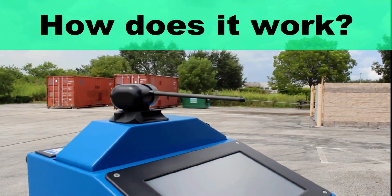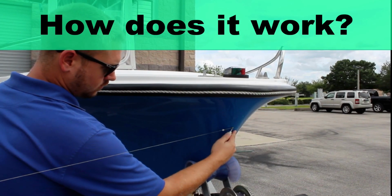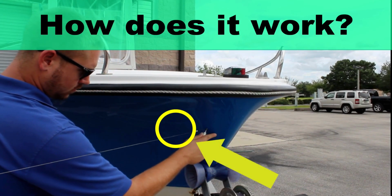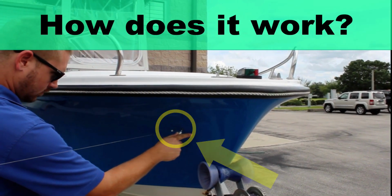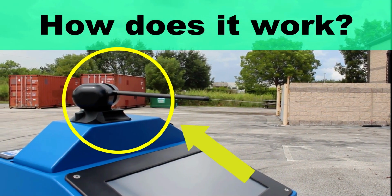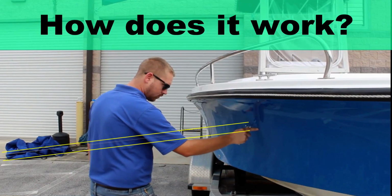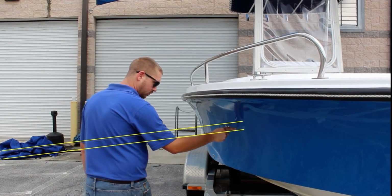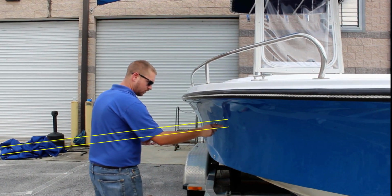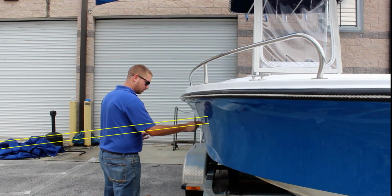Well, the Proliner is a coordinate measuring device, meaning that it captures points in space. These points are captured via a pen-type probe connected to a measuring head. The head can be rotated in every direction. The measuring head is connected to the probe via a cable, which can be stretched out over several meters. A button on the probe is used to mark and capture the relevant points.